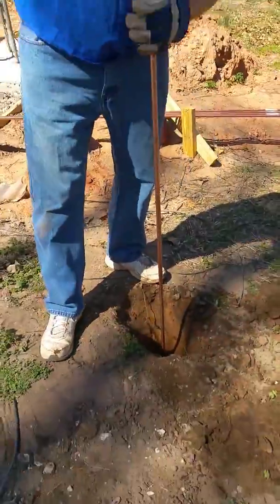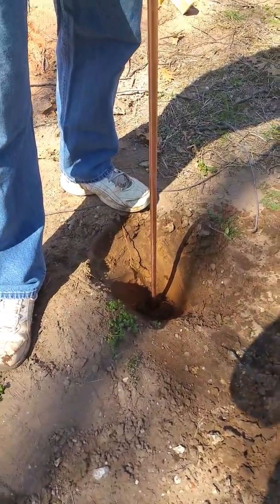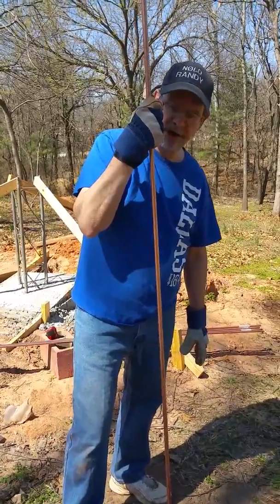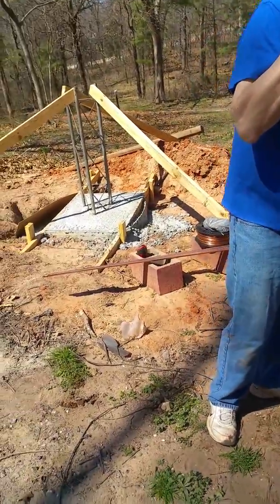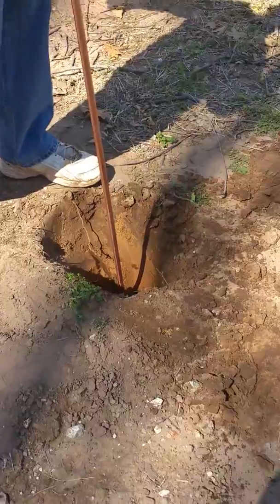With the hole down here, we put just a little bit of indentation because I like to put the ground rods below the surface so that when I tie the wire to it, it is all below ground and you won't walk on it — no trip hazard or anything like that. It is about 10 feet away from the tower base, and that's why it's recommended that you have a star pattern out. We're putting in five ground rods total.